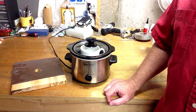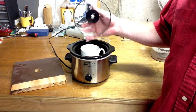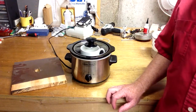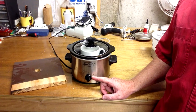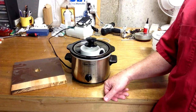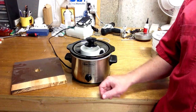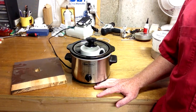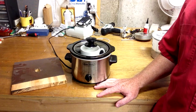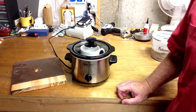Again it's been several hours since we put the water in. Make sure the water level is at least as high as the level of the glue in the cup or container. I'm going to turn it on to low. In the past I've turned it to high just for a little while to heat the water faster, but you have to be careful not to let the temperature get too high too quickly — overheating the glue can break it down and make it less effective.